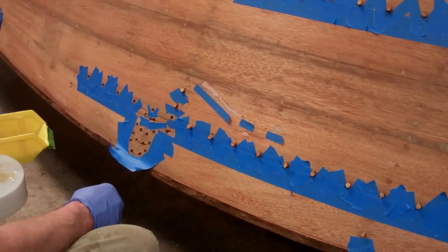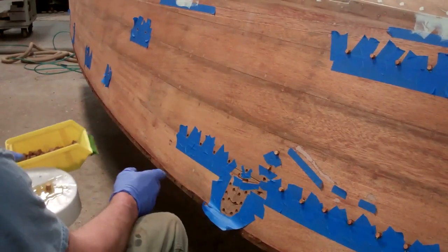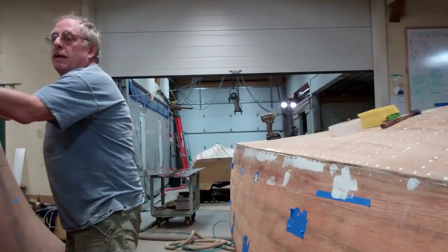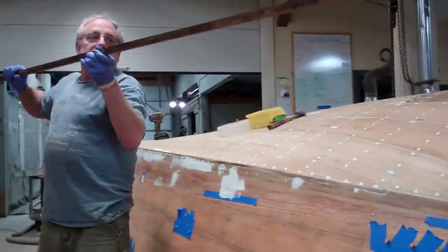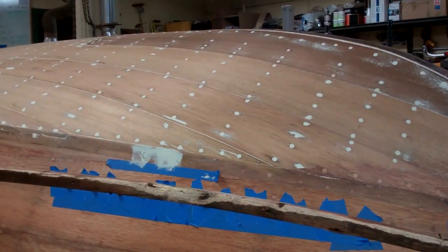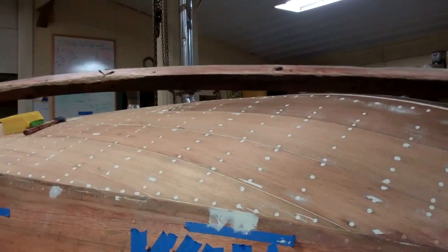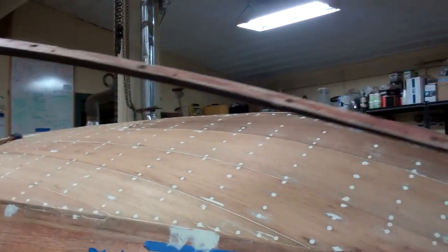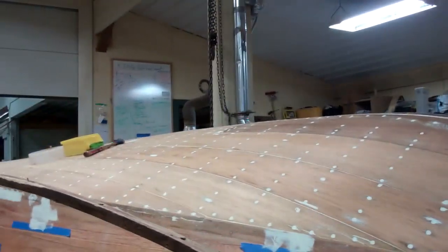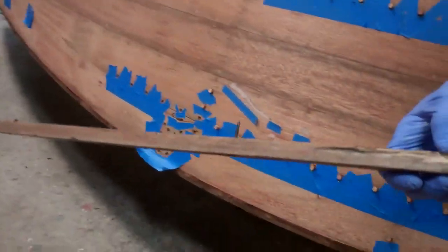John, I noticed that the trim rail on the gunnel is gone. Yes — this trim rail actually has some issues and it needs some work. This is the trim rail from this side of the boat, and as you can see right there, there's a nasty part that needs some work. I'll probably put a Dutchman on that. And the end — six inches on this one is broke right off. I'll actually have to extend it with a tapered piece on the end about six more inches. There's one more bad spot on this one also. The rail actually isn't in that bad shape overall; there are a couple of spots that need little Dutchmans.